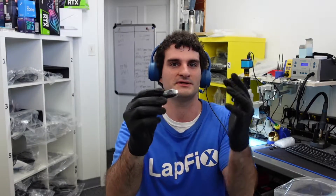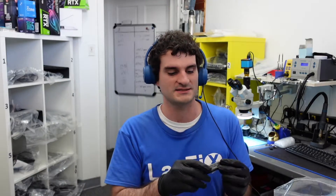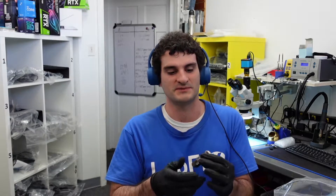All jokes aside, I never really want to open this type of device because whether there's a little PCB board in here or there could be a connection, maybe the solder is just a little bit loose in there — then you break it off, you can damage extra pads. Especially if you're really interested in getting data for data recovery, you definitely don't want to open any type of device because you can obviously make it worse. Sometimes it can be hard to find other components, especially this one. I may have to get a donor drive. The process is going to take longer, less chance for recovery. We always take it very seriously here. Try not to open it because the data isn't in here — you're not going to find it. It won't be apparent to you. You're not just going to grab your picture from inside. It's not going to work that way.